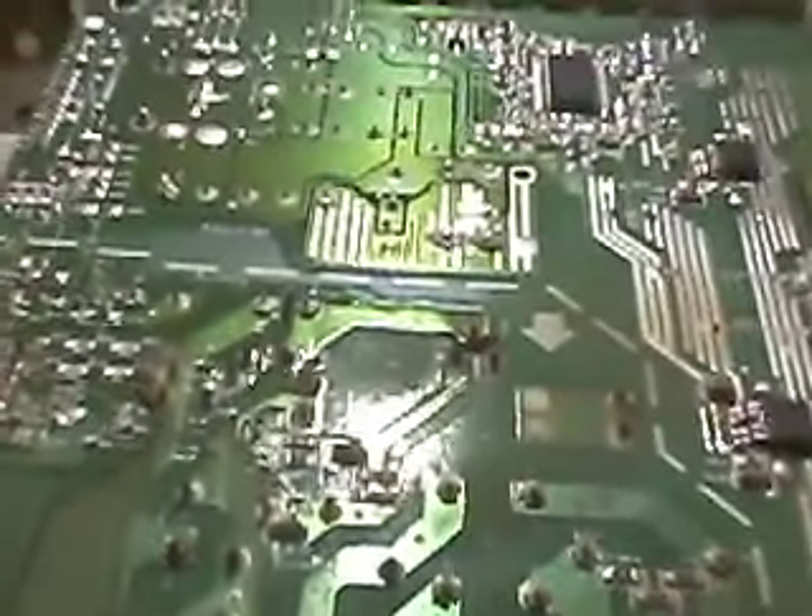It's kind of difficult getting bits like this. The whole thing is going to lift up but there's a cable down here which has got to be disconnected — I'll do that as soon as I get this loose. I've turned the board upside down and it is absolutely chock-a-block with muck and dust. These capacitors down here are all marked with little black lines and they've all burst by the looks of it.